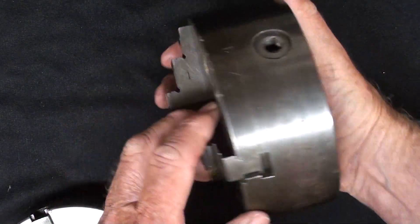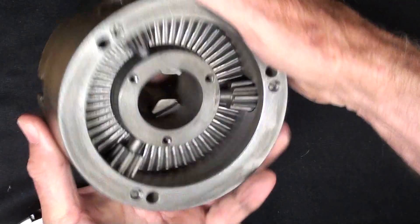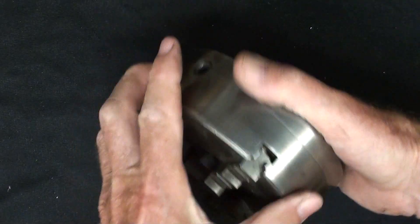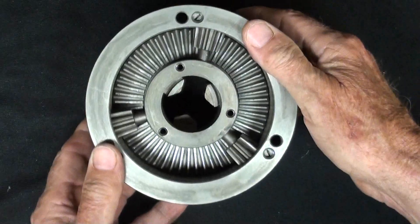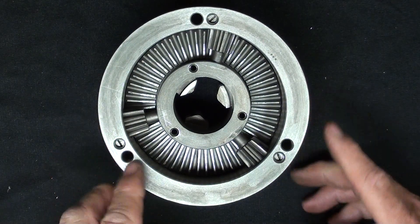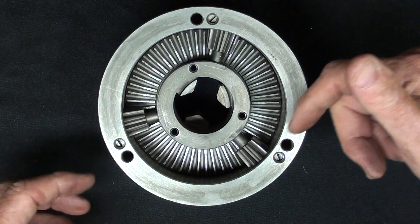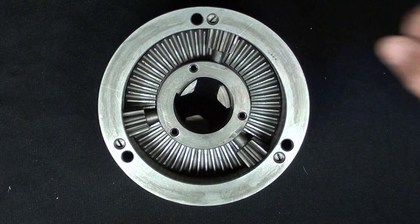Better chucks like this Bernard have three gears and three chuck slots, making it more convenient to use. On a cheaper chuck — such as this one off the Atlas — there's only one. That's less parts to manufacture, and the benefit is in the purchase price. Now let me take out these three little screws here. Those are keeper screws that allow you to get these little pinion gears out.